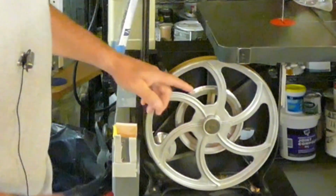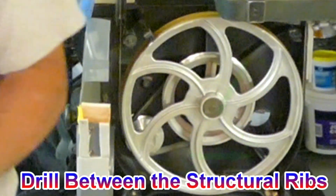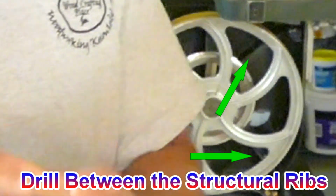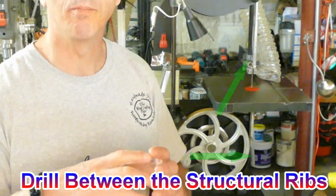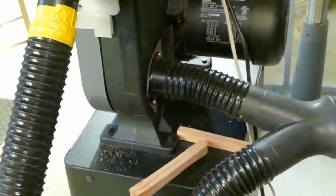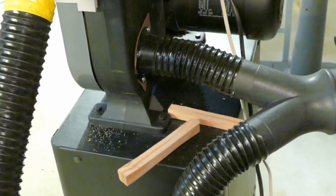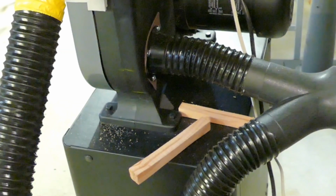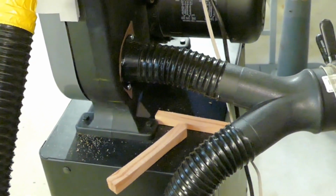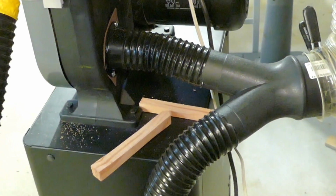Now in this particular case, I've already gone ahead and done it. There's not much to see down below here. I drilled a 2.5 inch hole with a hole saw, right? I used a bimetal hole saw and bored a hole through the back of the saw. Here's the third port, which I installed in the saw. That took a little bit of patience and a hole saw, and just sitting and working at it. The cast iron was pretty tough.